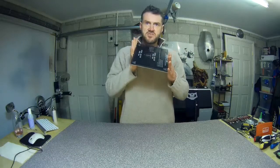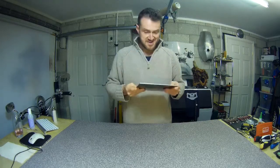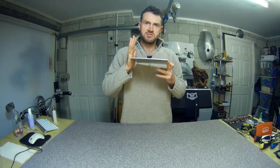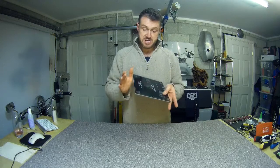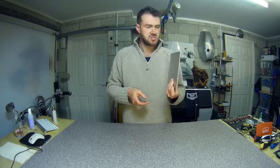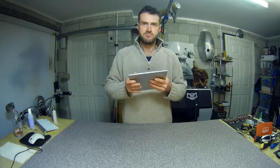Time for the heat bed, and this is possibly one of the weak links in the chain. It's actually very hard to get hold of a quality one without paying quite a lot of money. There's a company trying to make the Mark 42 type bed but they're not really available yet. Until then we've got this 3mm one, which is one of the finest Chinese pieces you can get for about 10 pounds or 10-15 dollars.